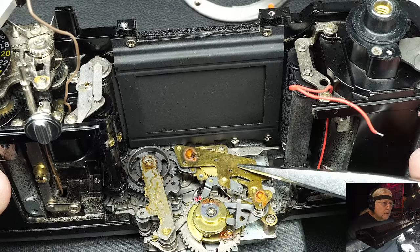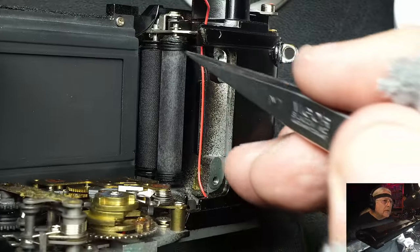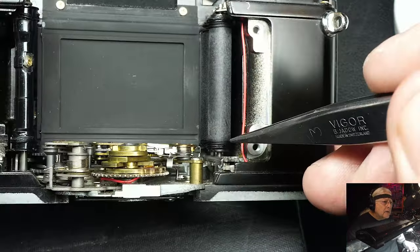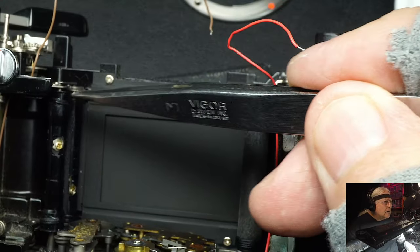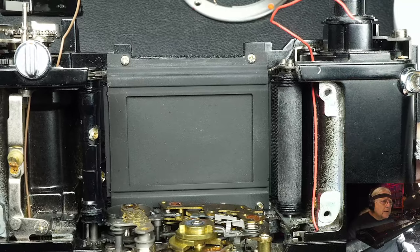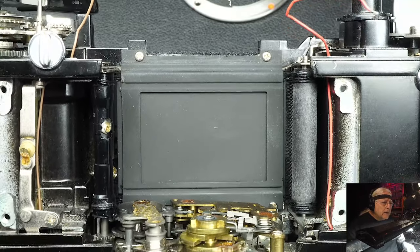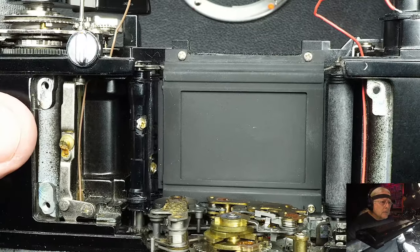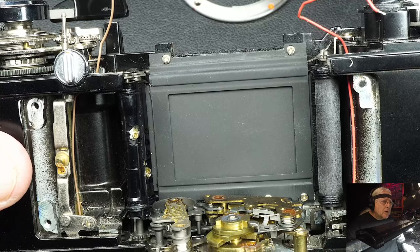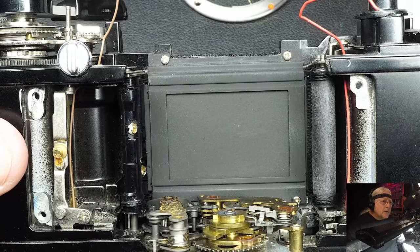When they put their glue on, they don't do a very nice job - you can see some here and some here. This timer here has to be oiled, and this release wheel here also has to be oiled. The shutter shafts all have to be oiled. Shutters on these mechanical cameras, after a while they dry out, and when they dry out the shutters start becoming jumpy or inconsistent. On some of the manuals it says the cameras are lubricated for life and the shutter rollers don't need lubrication. But that would have been true if the camera lasted 10 or 20 years. Some of these cameras are now getting up to 40 years old or more, and they have to be oiled.